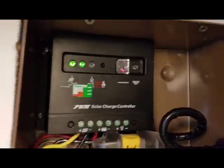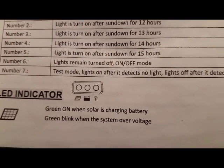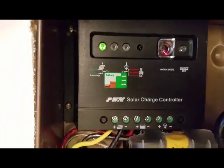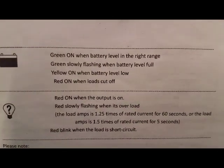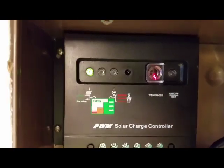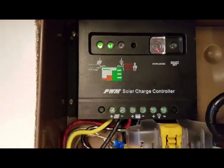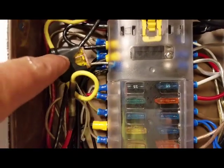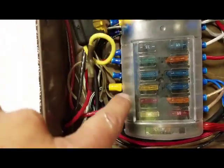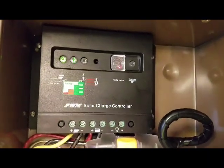So we're installed here and it's looking pretty good. According to the instructions, the left LED — green on when solar is charging — which is good. The center LED is the battery: green on when battery level is in the right range, green slowly flashing when battery level is full. I've been plugged into shore power all day so the battery is full, I'm sure. The right LED is for the work lamp, which I'm not using — it has a light function that would automatically come on and off in light and dark outside, but I'm not going to use that. So: fuse coming in from the panel, fuse going from the controller to the batteries, which bridges down to my batteries. We're installed. We'll see how she does. Thanks for watching.